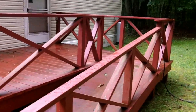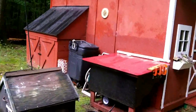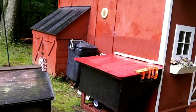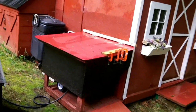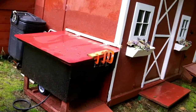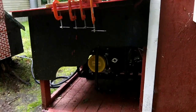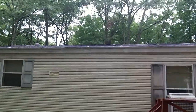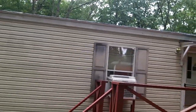I'm running all 10 gauge wire, including the cord itself. These clamps that you see on top of the thing are to keep the plywood from delaminating — I was having a problem with it delaminating, and I've got to put roof coating on that and some rolled roofing. But she's under there running at 122 volts. When the air conditioner kicks in, she momentarily drops to 119 and kicks right back up. It really surprised me because I didn't expect it to run the air conditioner.